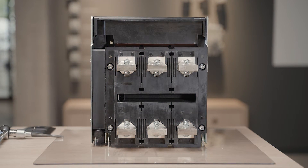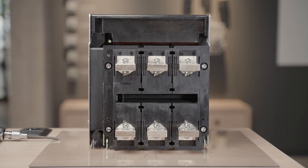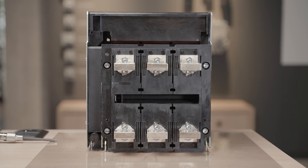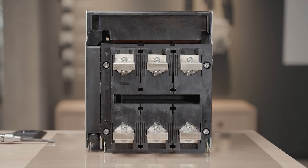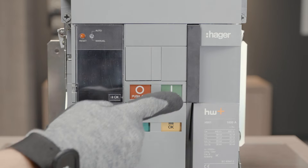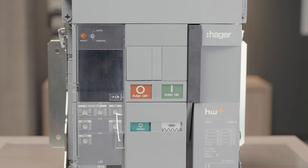The terminal connections are used to connect the circuit breaker on enclosure bus bar systems. The rear connections can be easily rotated in case specific adaptations are needed, horizontal or vertical. Before operating, discharge the main springs and open the circuit breaker contacts: push on to discharge springs, push off to open the contacts. The indicators must show open and spring discharged.